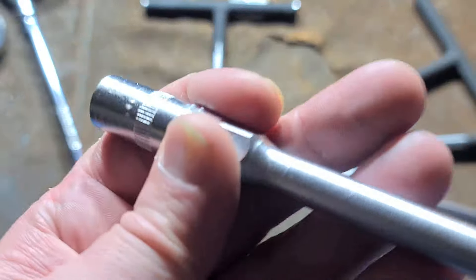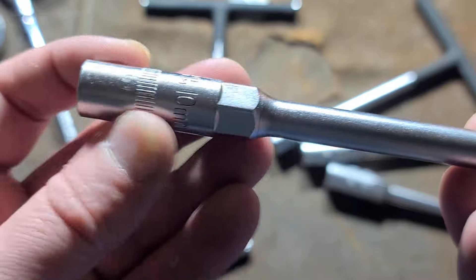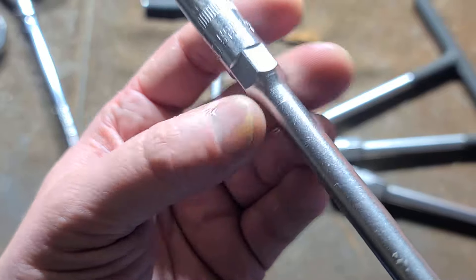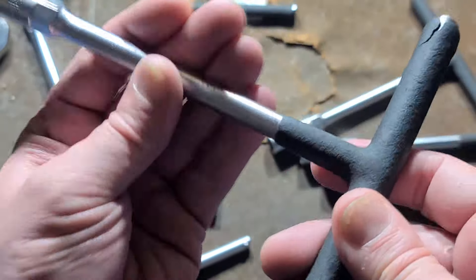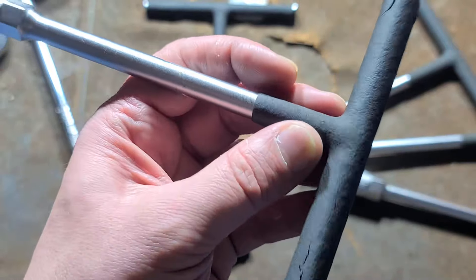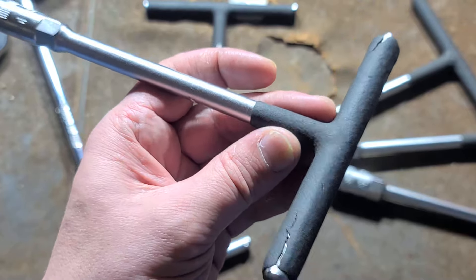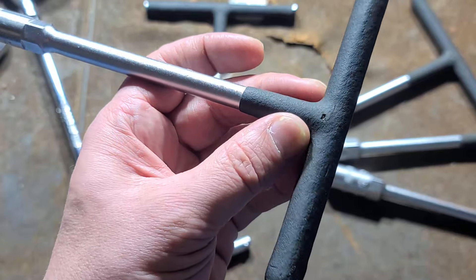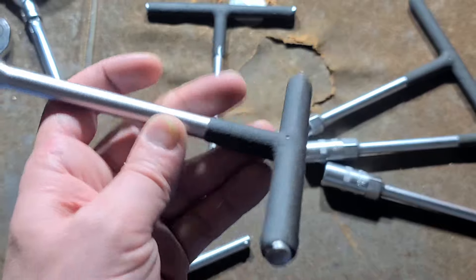Surprisingly, better quality ones — I really thought this was welded, but it actually appears that it was rod stock and they forged out the socket end as one piece, because there'd be a lot of likelihood of a weld failing right there. And apparently a lot of them friction weld the handles, which means they just spin the rod and force it into the steel — the friction heats up, melts, and mixes them together. This is replacing a lot of MIG welding and traditional welding techniques because you don't have to add any extra material. It's just a machine that spins it in — kind of like starting a campfire with two sticks.